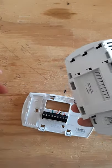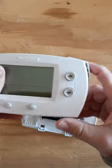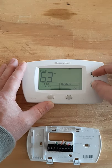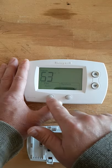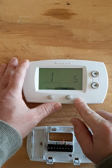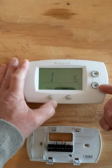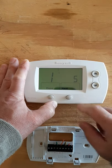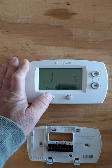I don't like batteries, but in some cases - like this one - I'm going to put two AA batteries in. One good thing is it'll power your thermostat and you can actually go in here and do the configuration. This combination of switches puts it into configuration mode, and once you're in there you can tell it what type of system you have, how long you want the time delay, whether you want Celsius or Fahrenheit, and all those options. Some more sophisticated thermostats have hundreds of options, so just make sure you read the manual.